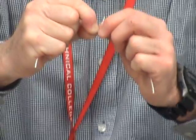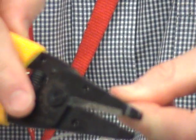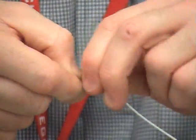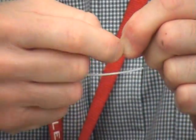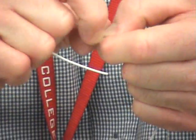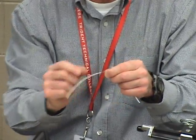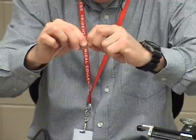So I got one, as tight as I can get. Doesn't have to be perfect, but it's got to be tight. Two, three — I'm going to trim it so I just get a fourth. Four. It's really hard at the end there. Use your fingernail, bring it around tight, you got to work it. I don't want ends sticking out, so I'm going to trim it a bit. I don't want that poking through my heat shrink when I get done. Same thing here — I'm going to trim it up. It's not sticking out. I got the windings. I'm going to straighten it up as much as I can.